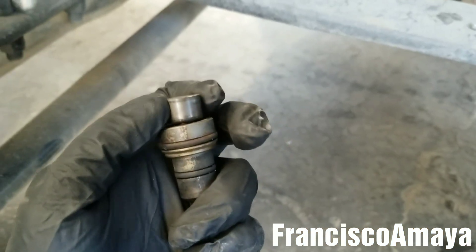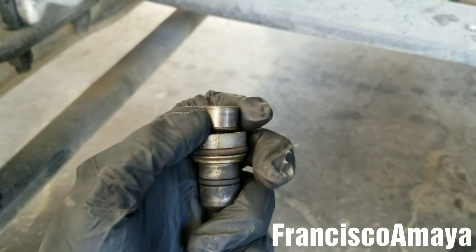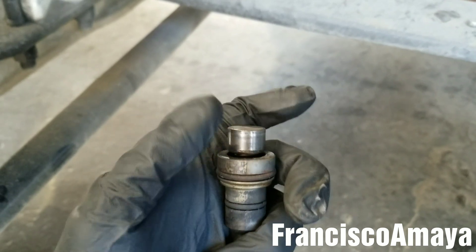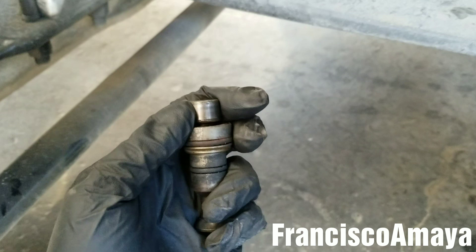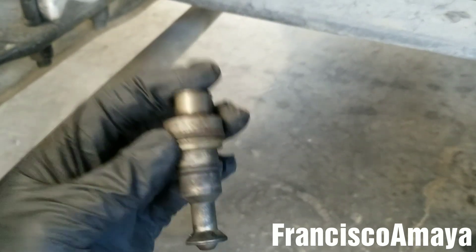This top is the one that gets stuck, and when the air compressor needs to recharge, this doesn't open and it stays closed — telling the air compressor that you don't need air. And that's the reason it never recharges the system.